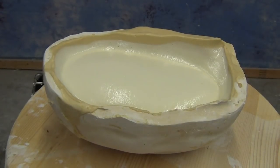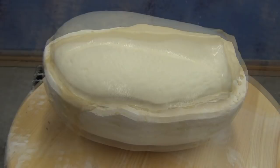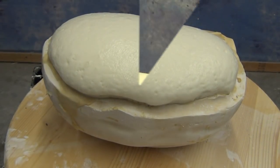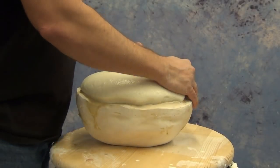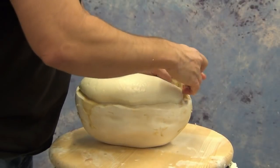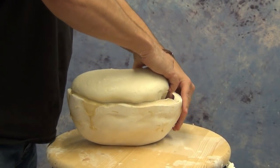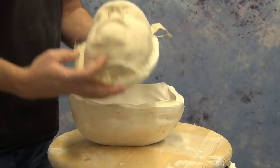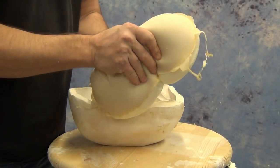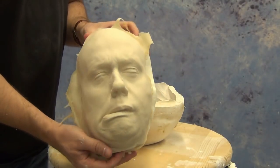The TC-266 is a pretty fast setting foam, so it'll free rise in about two to three minutes to its full expansion rate. After about 20 to 30 minutes, you'll be ready to demold. For a more complicated mold, it's a good idea to cap your mold to build back pressure to help force the foam into tight areas. For a simple open face like this, letting it rise in an open mold is okay, but with back pressure you get a much better quality part.